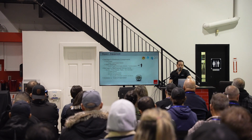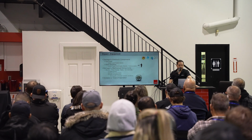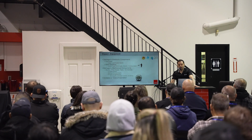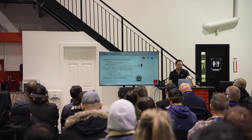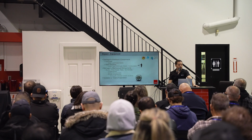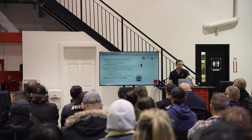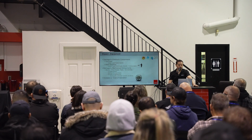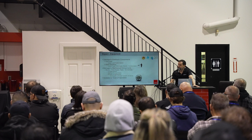damage to mechanical components. So again, your motors, print heads, fans, the ink delivery system. All right, so it'll increase the wear, which will cost you more in the end. Build up contaminants in the ink, right? So that'll damage the print heads and your dampers and the ink system. And increase your maintenance, so more time involved in maintaining these. And in the end, it'll increase your cost of operation.